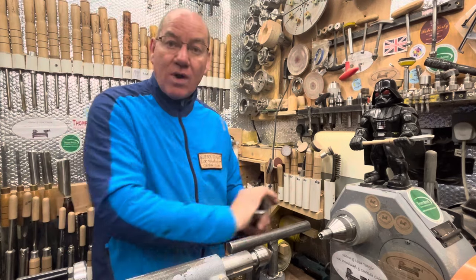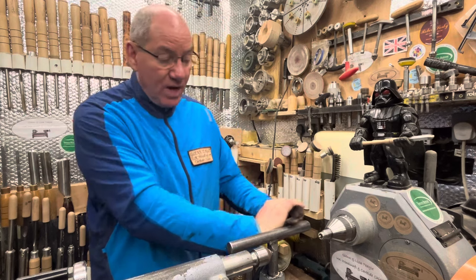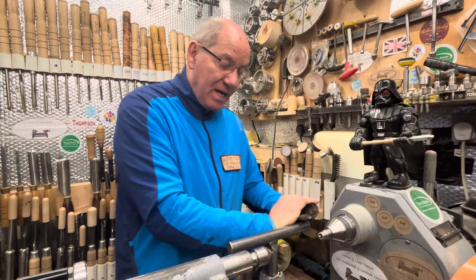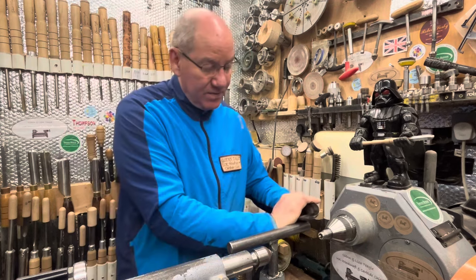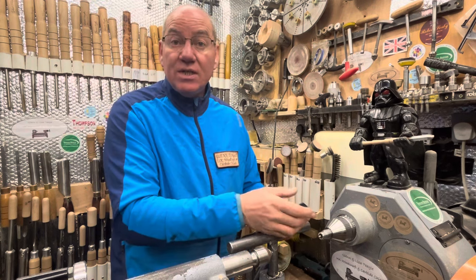It will just go over it. You'll hear it straight away. You go like that, you can do one, you can do two. Back cut, then come forward. Then back cut, then come forward. Then back cut, then come forward. On your last one, you come back, you keep going until you get shavings.